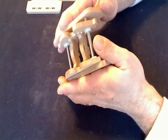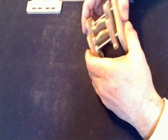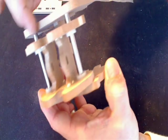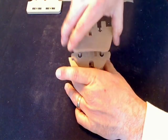We're going to locate C1 — this is what it looks like — and we're going to line up our recess holes here with our two shafts, and the slot here with the tab here. I'm starting at the tab and just moving it around until I get it aligned. Now you can press it together and try to get it lined up. You may find at this point that with part D here it should be flush. You may also find that one of the rods doesn't fit all the way — I can see that rod is short.